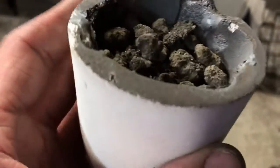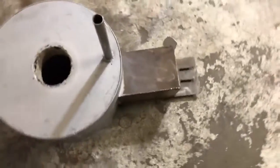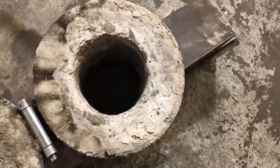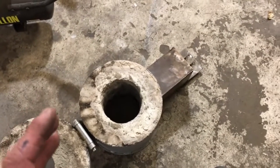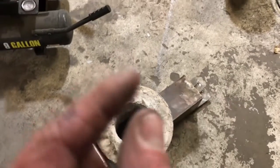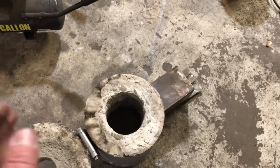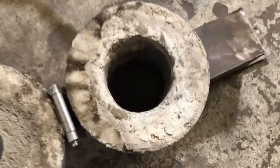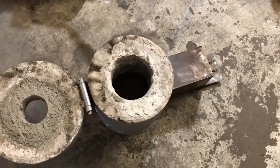We are going to take this crucible — this is a ceramic aluminum crucible — and give it a shot. We will be running that in this direct flame impingement foundry, which burns a little bit hotter than your average cyclone. The flame impinges directly on the crucible itself and it's set so that the flame tip is just touching the crucible — kind of like when you take a blow torch and hold it to just the right spot, the hottest point, to melt your braze alloy. It should be over 3,000 degrees; we're going to check that out and see if we can melt this.